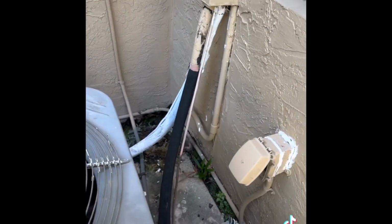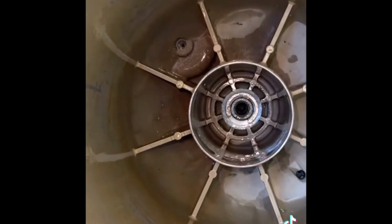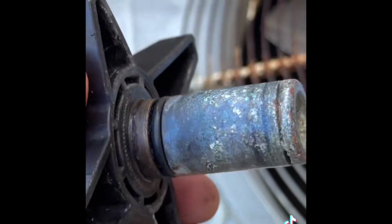Next thing we gotta do is go ahead and we're going to lay it down. Show you how to replace the knob and cap kit. Basically is how it is. Right inside of there. See the C-clip, that metal C right there. And we're removing that and then taking out the whole knob. All right, so the handle removed.